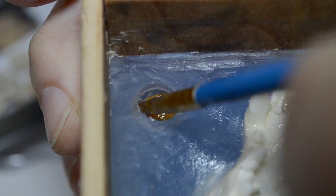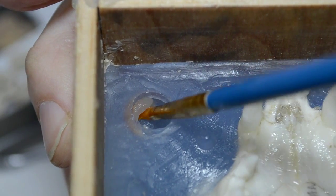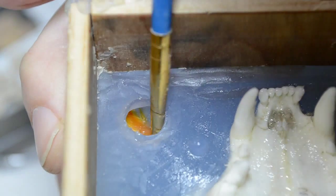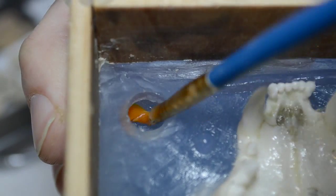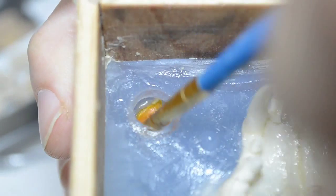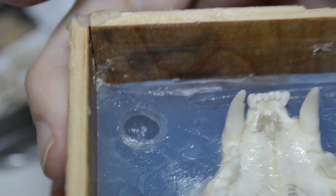You go in there with a brush and press down on the brush and then spin that brush. And you notice the bristles are going underneath the little ledge that forms the mushroom cap feature of these little wooden buttons. Okay, like so. Then you can take out your excess. And you go around again. Just make sure you cover the whole thing. Make sure you get the excess out. Okay, you don't want to leave any in there.